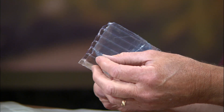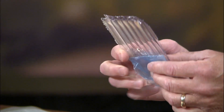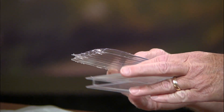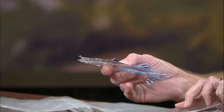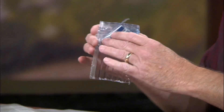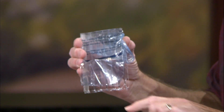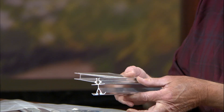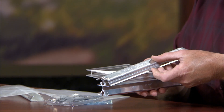Most homeowners will want to use this — a twin two-layer polycarbonate sheet. This is readily available locally at lumber yards. This one is 8 millimeters thick and it's fluted, with just as good insulative qualities as the acrylic. It's more cost-efficient because it can be applied directly onto the structure and you can screw through it. With plexiglass you cannot run screws through — you have to use a glazing extrusion where the panel goes in and then a glazing bar snaps over the top.